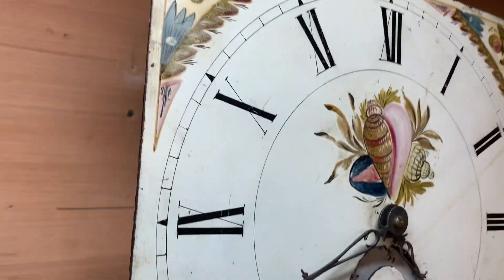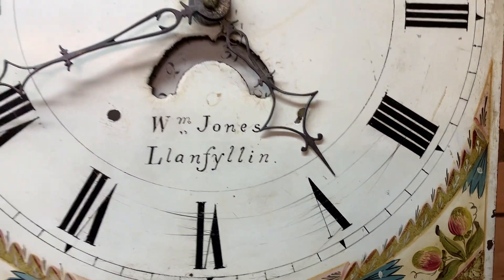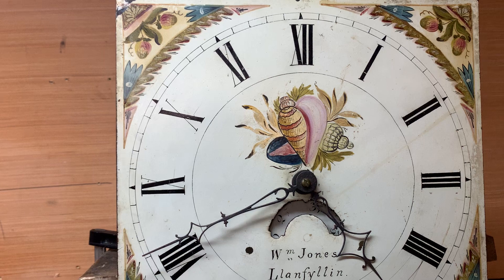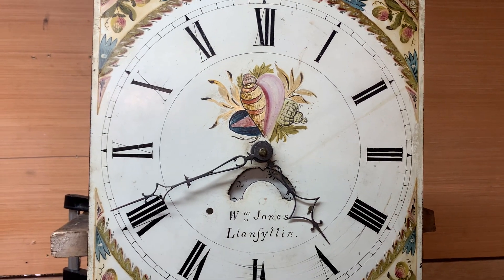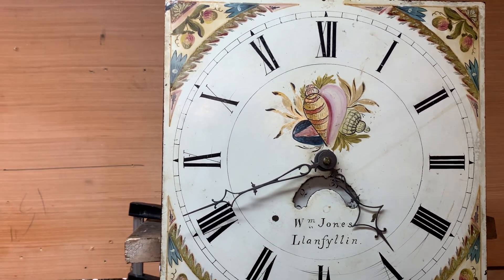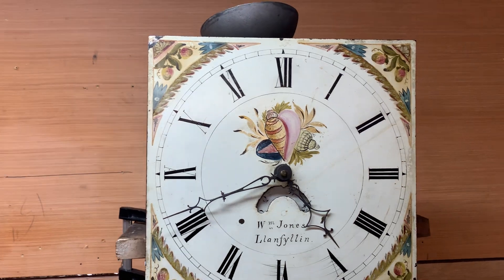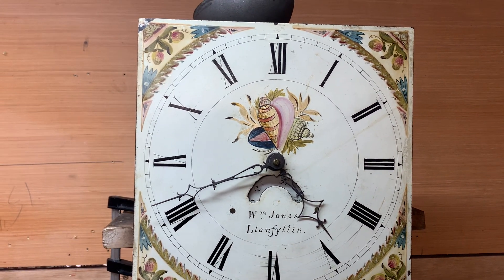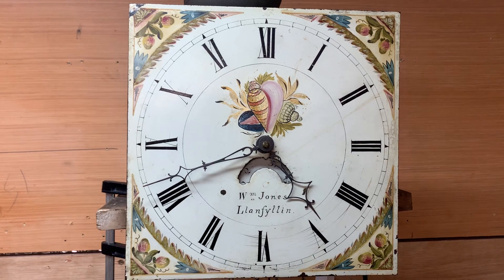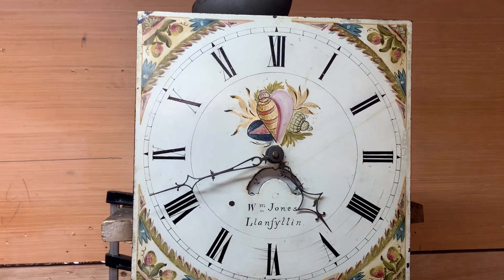If you come down to the dial you can see there's a lot of marks on it. The reason for that is the cannon pinion on this particular clock was bent completely out of shape. I'll do another video on that because it's a little bit more involved than I want to cover here. But anyway, we heated it up and straightened it all up and got good results with that. You've got to understand it's also conical, so it's not just a matter of straightening it — there's a lot more to it, really.